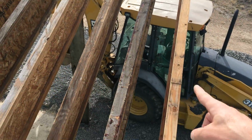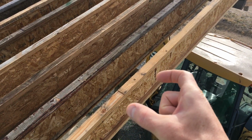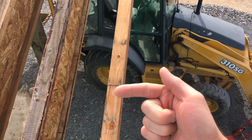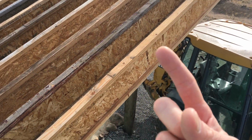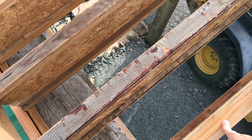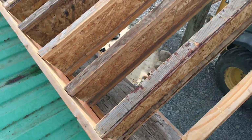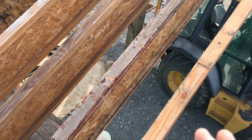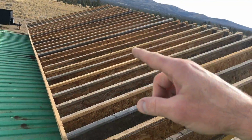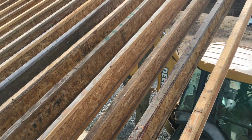The way these things are strong is they're strong down and maybe pulling and a little bit squishing. They're not super strong sideways. That's not a great strength of theirs. And I'm just assuming that up is not super strong as well. So that's why I'm tying them in, so the strength is all transferred. The wind load, the load that would pick it up and pull it away, would separate everything in theory. So while I'm tying those down, there'll also be an entire row of this same stuff down the center, just cut and mounted in there, right? So I've got zero worries about this stuff.